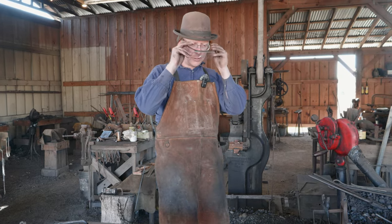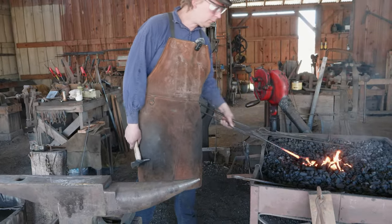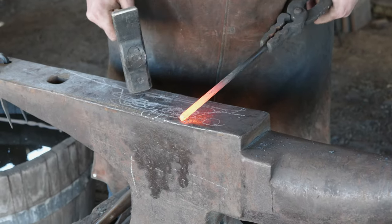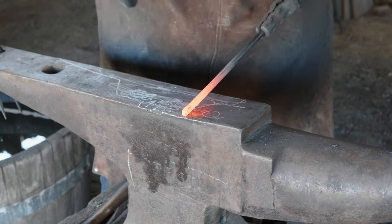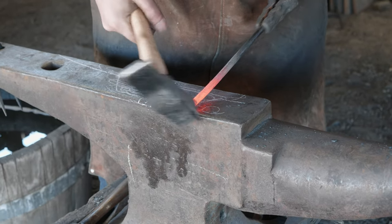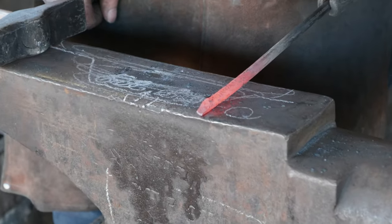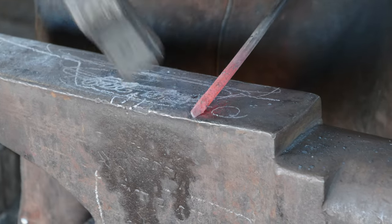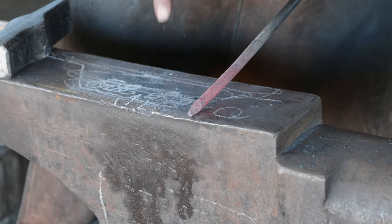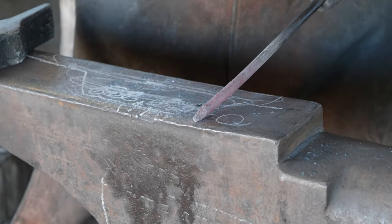With all that said, we do have our piece hot. Let's grab it and we're going to put our initial scarf on it. I'm going to come in and give it a couple whacks from each side, and then we're going to put a short taper on it. What I'm trying to do is make sure that my taper here doesn't grow wider than my bar — I want it a little bit narrower than the bar. So keep those ends knocked in — nice and short.